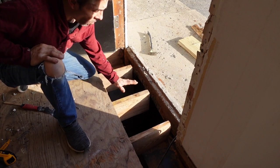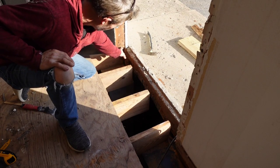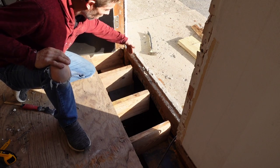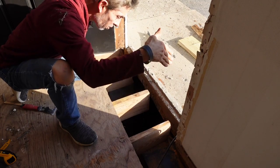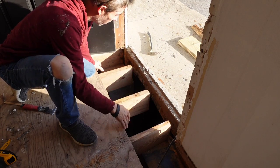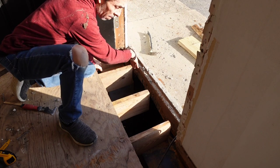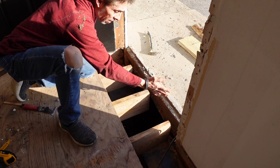Guys, remember where I said I wanted to double it up? I went ahead and tried to put the joist in here just to fit it. Like I say, it was a little longer at the top, and shorter, kind of on an angle, and that's okay. But just trying to slide it down in here like that, you guys know, you gotta put a square block in a square hole. It's not gonna work if you teeter-totter it like that. So by cutting these back another inch and a half, making it 3 inches, I'll be able to slide that beam down in there and pull it this way and then slide it back and tuck it back in.